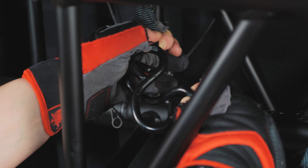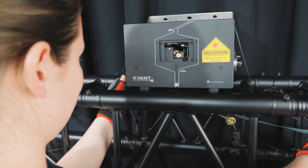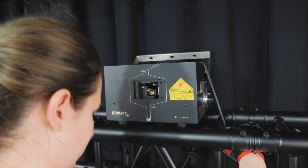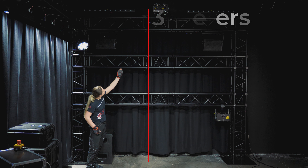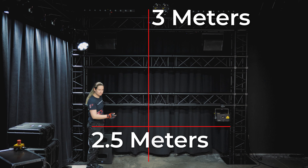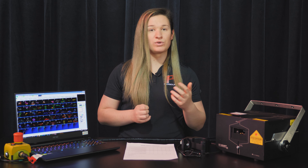If you're going to sit the projector on top of a surface like a truss or a platform, be sure to strap the projector down and use a safety cable through the eyehook. As for where you can actually mount the projector, the standard rules are three meters off of the floor where the public can access and 2.5 meters to the side where the public can access. In most places, performers and staff are exempt from this rule given proper safety protocols, but there are a few exceptions — check with local governments or local laser safety officers. Also, be sure your rough beam path stays within those three meter and 2.5 meter ranges.